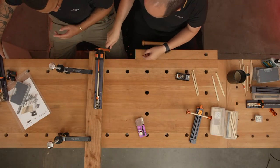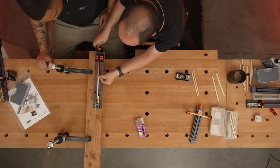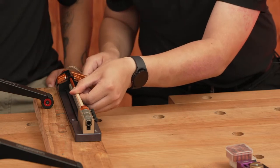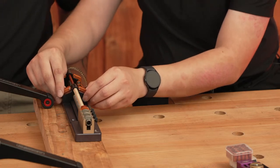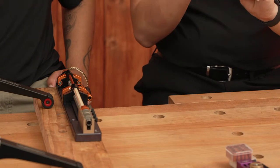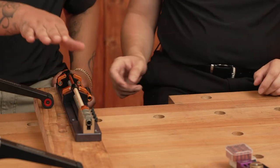This crank handle here is what pushes the pencil forward. So I will align that little piece up with the jig, just like so. It fits. It looks perfect, and we will start pushing it up like so. This one is a block that pushes up against the end and helps prevent the wood from splitting in case it wasn't glued or dried correctly. If you push, you'll apply force, and this could split the wood. So this prevents it from splitting. Okay, so always push this up as a stop. Keep it with the pencil as you push it through. Correct.